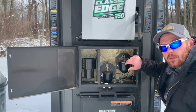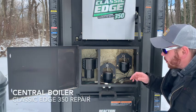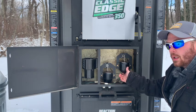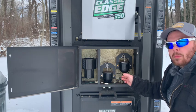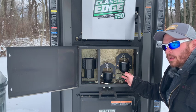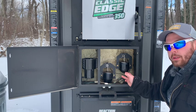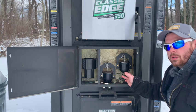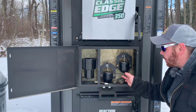For the last month or so, I've been having trouble with the fire kind of going out, but it's smothering itself — it's not getting any air. Originally I thought this primary air tube was sticking with creosote buildup in the top here. So I took it apart and cleaned it, and it seemed better for a week or so. Then I had to take it apart again because it started acting up again. That was a week ago. This morning, just after I got to work, my wife called me and told me that the boiler had gone out. She turned the power off, turned it back on, and it came back up and was running like it was supposed to — came up to temperature.